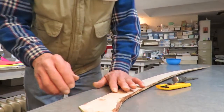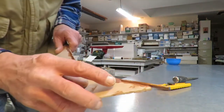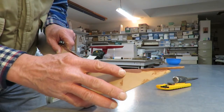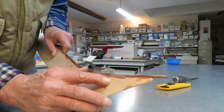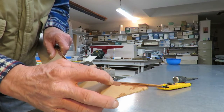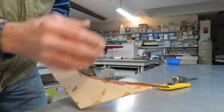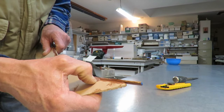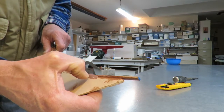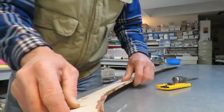Now we've pulled the tape off, and here you can see underneath the tape we get quite a bit of epoxy fill. There are a couple of ways to handle that. Probably the easiest is to catch it while it's still partially cured. If you take the tape off too early everything's going to fall apart - this is not at all sticky but I can gouge it with my thumbnail, so it's still a little bit rubbery.